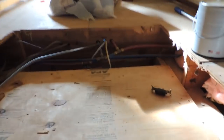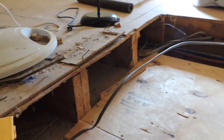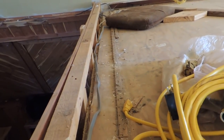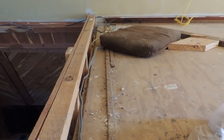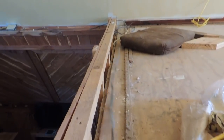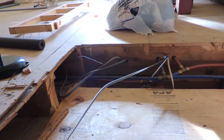First thing on the agenda, I'm gonna fix up the stairs so I don't have to deal with all this. I may put a piece here and there for a nice step. I'm gonna pull up all this carpet tacking, clean and sweep this off, and start working on the railing. The floor joists are running the same way so I'll have to find the spacer boards — there won't be any, so I'll figure it out. I've got some landscape timbers from the garden bed that'll make a fine railing. I've also got plenty of slack in this electrical line to get everything tucked away.